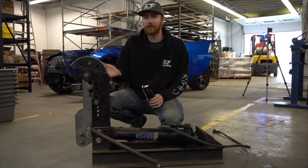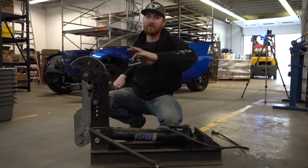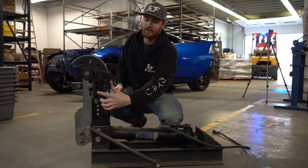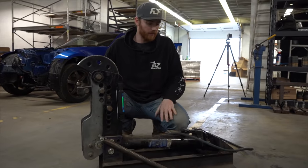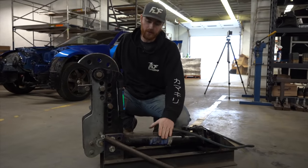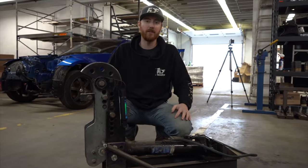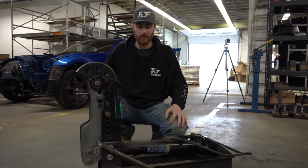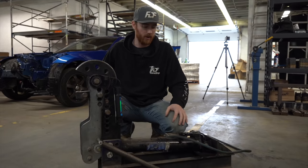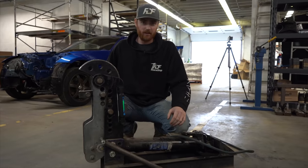It also is good for space. I know a main hoop in a shop takes up a lot of floor space to do. So when you go up towards the roof, you just need a straight line. This tube bender uses a pneumatic hydraulic cylinder. It can do 55 degrees per pin position. So to do a full 180 degree bend, it actually doesn't take that long to do with this. I would recommend getting something hydraulic, because doing it manually can take a long time.